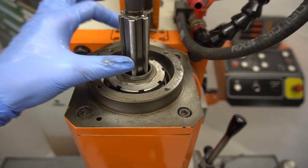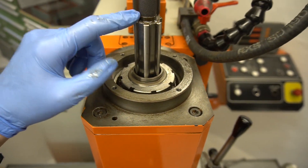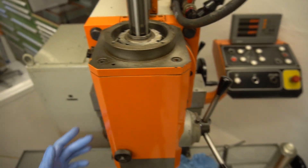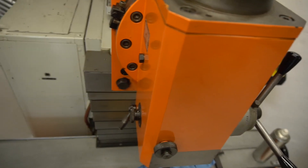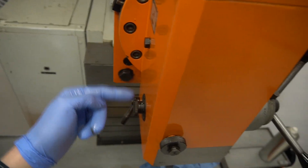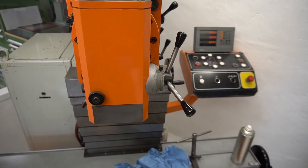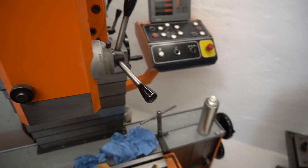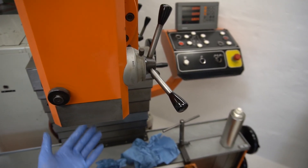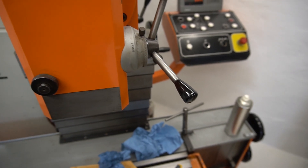You can see those splines — these splines are part of the quill or the spindle and they need to match up with the splines in the quill. So you need to be aware of that, as well as the key for the quill guide: pull out and twist, and now it just falls into the key slot. It takes some time to get comfortable changing the quill, and it's a good idea to raise it over the knee or table so if anything should happen or you drop anything, it won't land so hard. Also apply a piece of foam or wood or something not too hard.